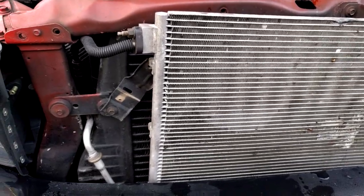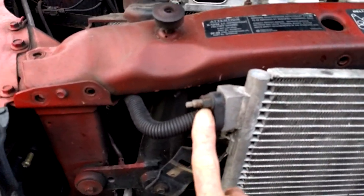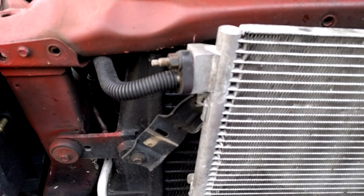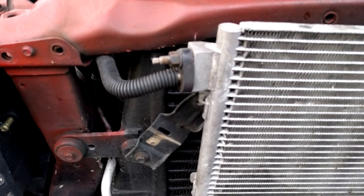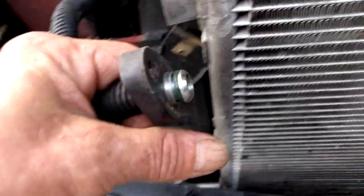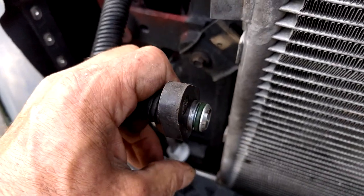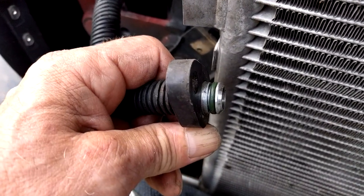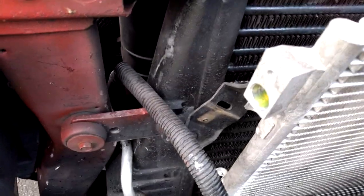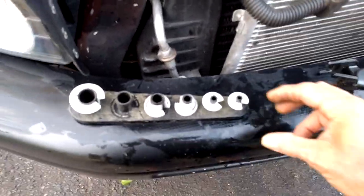First thing is a simple nut here — take this nut loose and it'll give us a little bit of slack. With the nut loose, now it's time to take a look. There's a rubber O-ring here — make sure your O-ring is in good shape. It doesn't hurt to put a new one on if it has any kind of nick, because it seals inside there and it will leak.